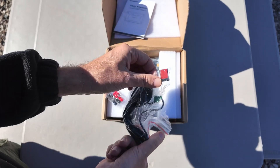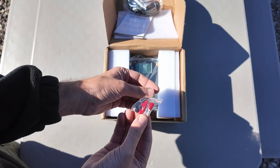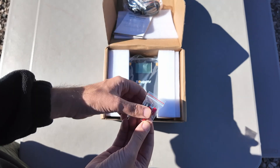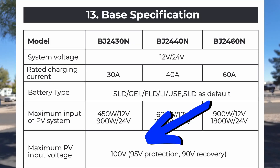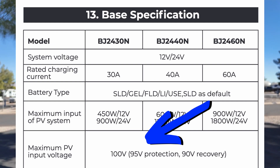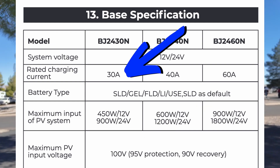We have a temperature connector and a couple of fork terminals which you can use to plug your wires in. I brought some wires to make this easy for me, and then the charge controller itself. You should read the owner's manual on these kinds of things — you want to make sure that your solar array's input power does not overpower the charge controller, and you want to make sure that the charge controller's output doesn't overpower your battery.